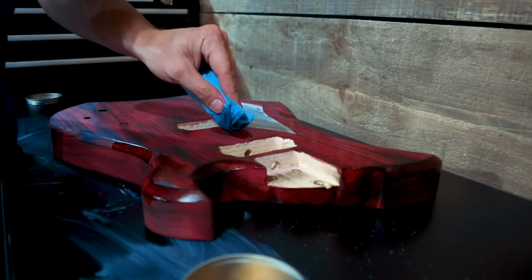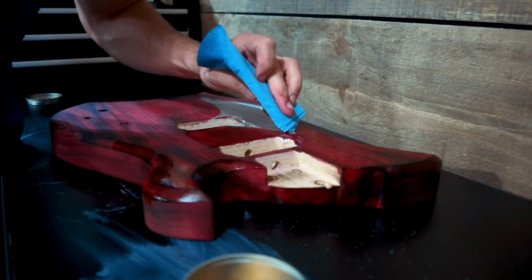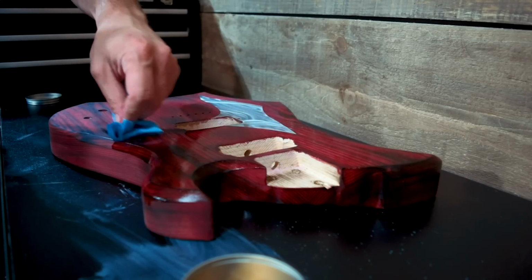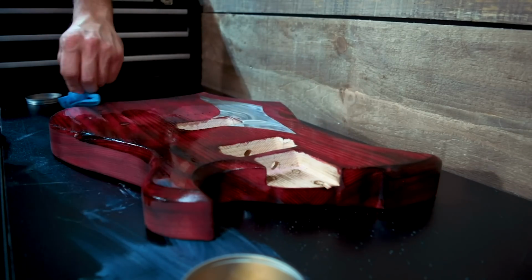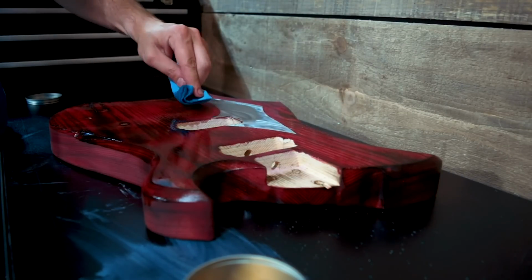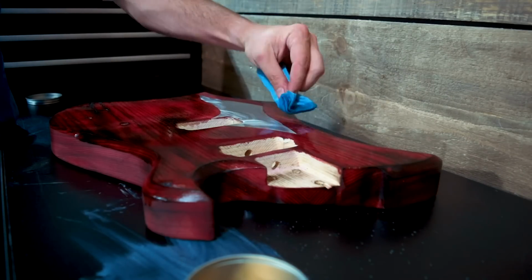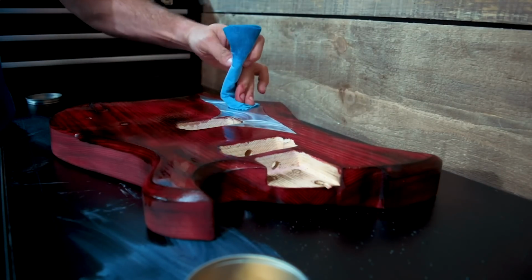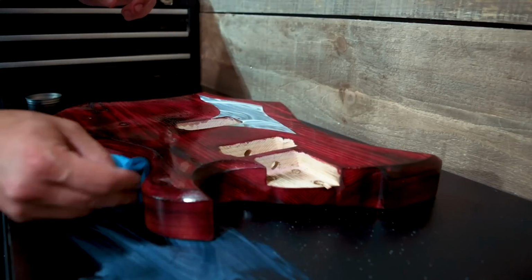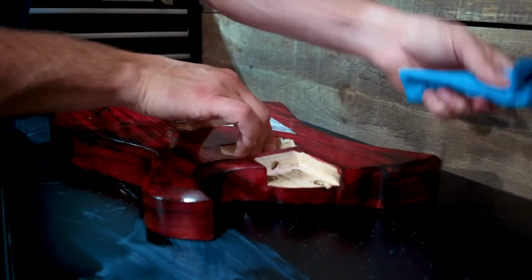So this is going to be my last coat, and I'm going to apply this just one wet coat like we talked about. I'm going to wait and buff off just a little bit of it, but I'm leaving a little excess because of what I'm doing next. So this coat goes on beautiful, nice and smooth, exactly how I want. And I'm sure I've said this too many times already, but I'm very happy with it. The finicky part here is avoiding the aluminum for the oil as well. It won't stick on there properly anyway, and there's no reason to have it on there, so I'm trying to keep away from that. This is a pretty quick process, luckily, because I didn't leave myself a lot of time to work on this and to finish off this finish. But luckily, like I said, the next day this is going to be ready to go, and I can move on to the next part of what I'm doing.